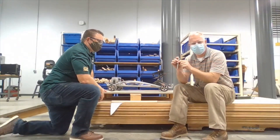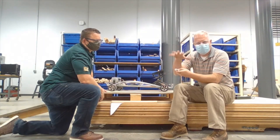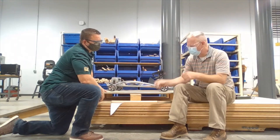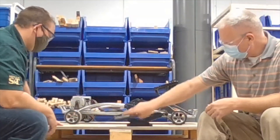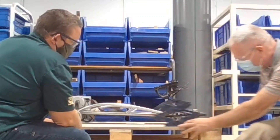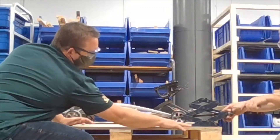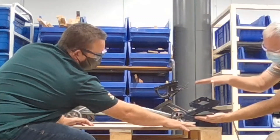The screw is another one of the six simple machines. A screw like this — a fastener — is used to hold parts together, whether assembling an automobile, putting a deck together, or building something around the house. The screw actually clamps parts together, and that's the work it does. But I'm talking about something like this. This is a screw jack. Just like your threaded fastener, this jack has a screw in the middle, and as I turn this handle, it turns the screw, which draws these two parts together, effectively raising it up.